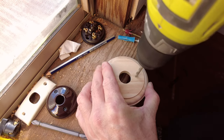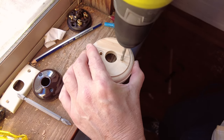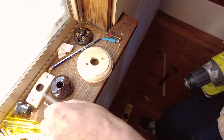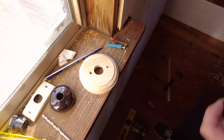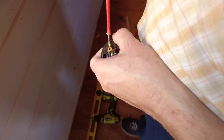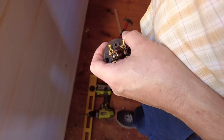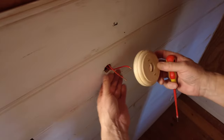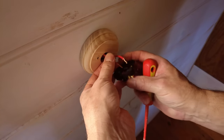So these just go straight through. Now we grab our switch and work out which is the top and which is the bottom. We are wiring up a single switch — we've got our two switch wires sticking out of the wall. For Australian and New Zealand installations there's no junction box behind this as there is in North America.